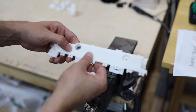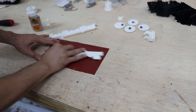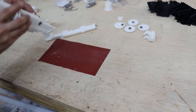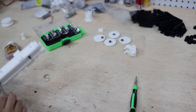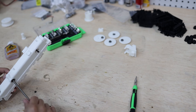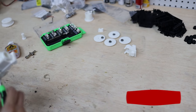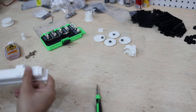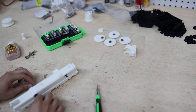Not too much pressure here and it's already done. I usually sand the pieces before gluing so the glue can have more surface to grip. Before applying the glue I use the five millimeter threaded rod to screw it using these nuts, and also a three millimeter screw to check that everything fits together and the position is correct. I'm going to use these to hold the two pieces while gluing.